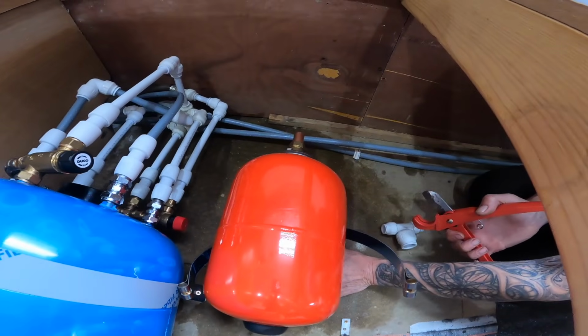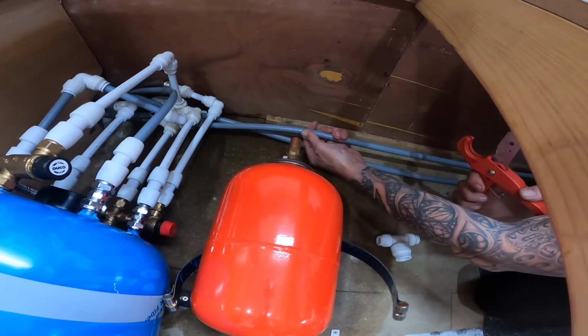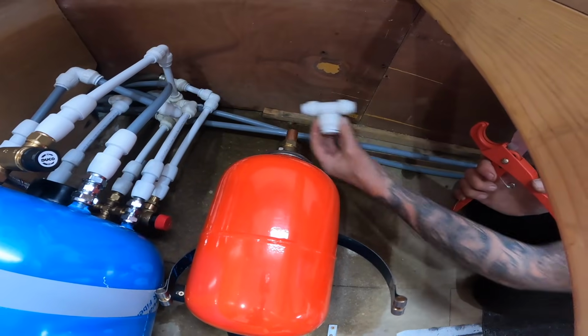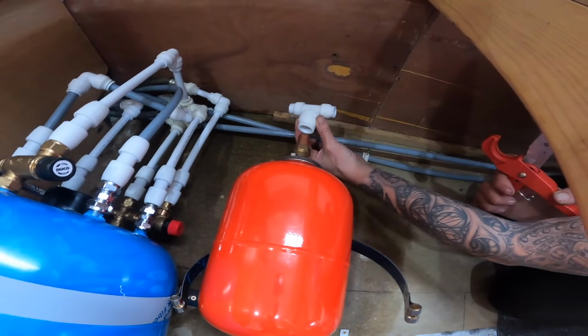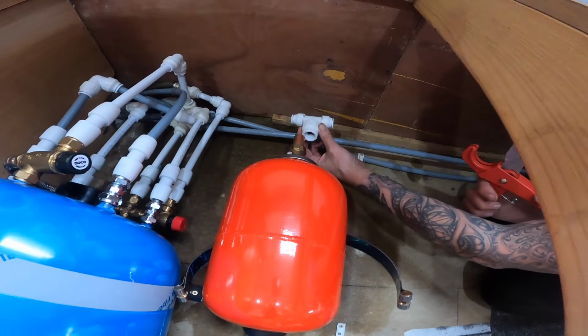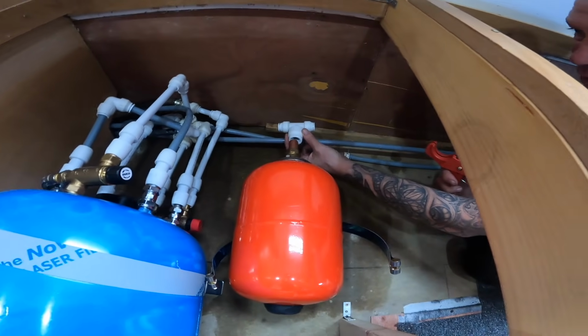We're going to cut the hot water outlet for the domestic supply there, and then connect a T-piece in, which is 22 mil onto this side and 15 onto that side. Okay, and that's definitely the hot water pipe, not the cold. We don't know yet. We'll find out when we don't get any hot water.